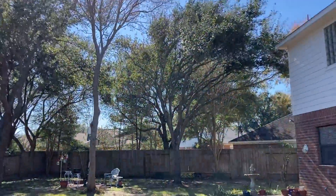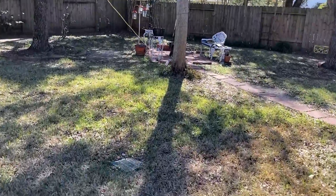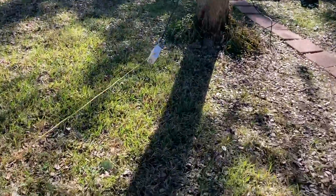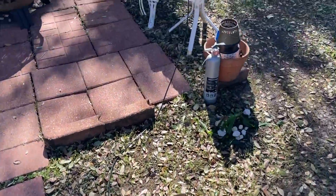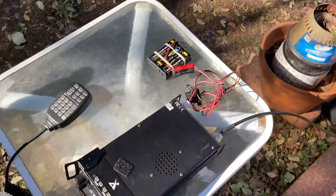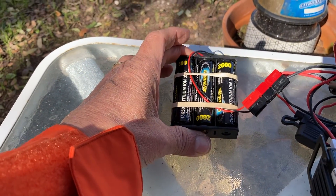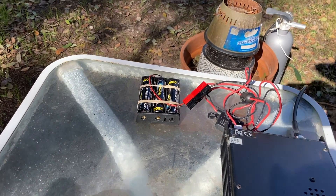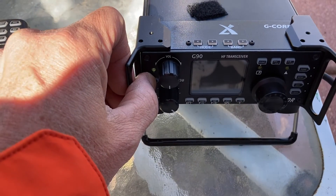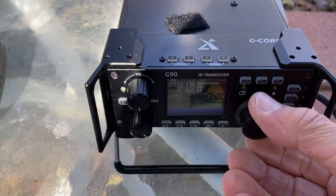The antenna goes into the station here via coax cable. I'm powering up with 2.7 to 3.7-volt 18650 batteries — 2600 mAh — powering the G90 radio. This is from Colorado.